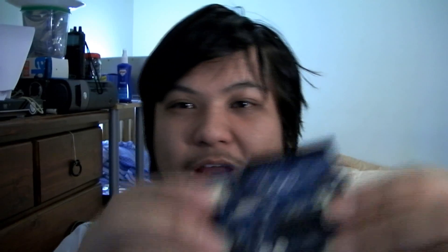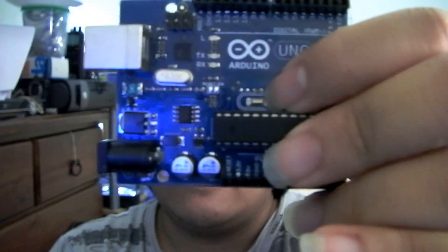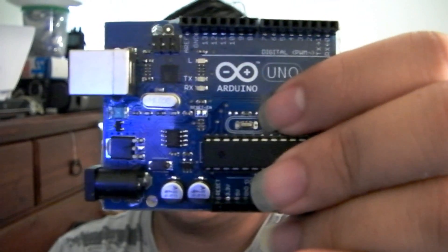Part of the problem with the Arduino is timing. You'll notice that I'm not using a real-time clock. If you wanted really accurate timing, you'd use a real-time clock module, which gives you the present time and date and keeps it quite accurately. Instead, we'll be using the microcontroller's onboard free-running timer, which relies on a crystal — or in this case on the Uno board, a ceramic resonator. This clone board has a dual footprint allowing you to install a crystal and its capacitors, but this one has a resonator. The problem with the resonator is low accuracy compared to a crystal — you're looking at 0.1% drift in terms of frequency, and it could be worse depending on the temperature. So in terms of timing accuracy, it's not as accurate as if you had a real-time clock.